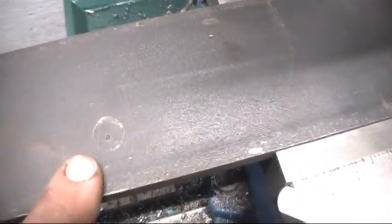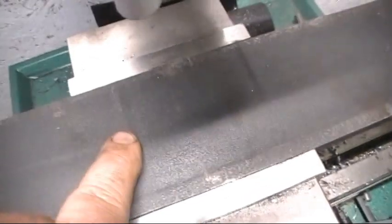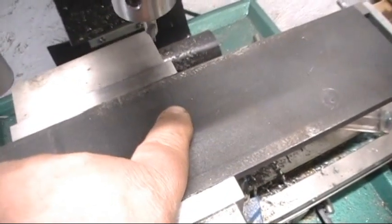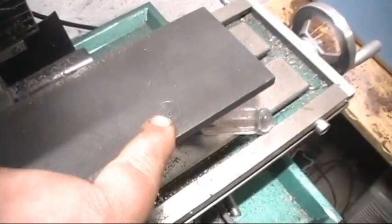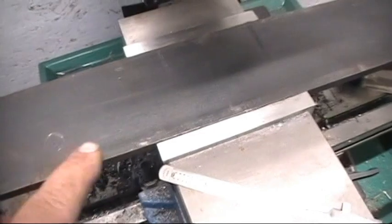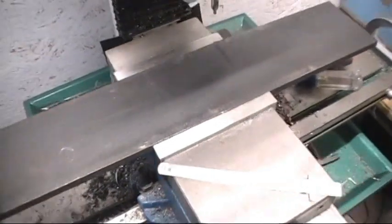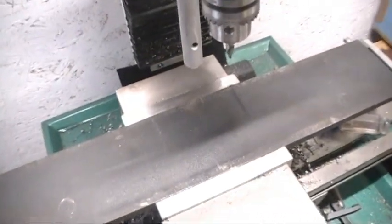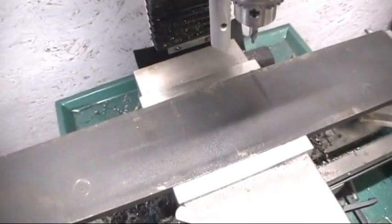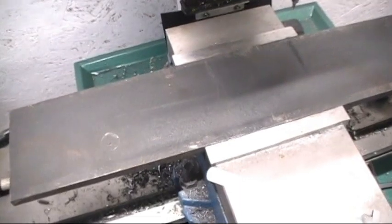I know it's going to be hard to see, but I've got 4 holes drilled. That's 1. You can't really see the line very well. 1 there, 1 here. I'm measuring this off completely with the machine because I want it as close to the edge as I can get. Of course, here's the other. Like I said, it's crooked, what I'm working with. So this hole's actually set in further than this hole. But if I don't, the metal is crooked on the plow itself, on the cultivator set, and it looks funny behind the tractor if the cultivator is set in one way and this piece of metal set another. So we're going to try to line everything up and keep it straight, even though the holes are not drilled straight. It'll look better anyway. Let's get to drilling.